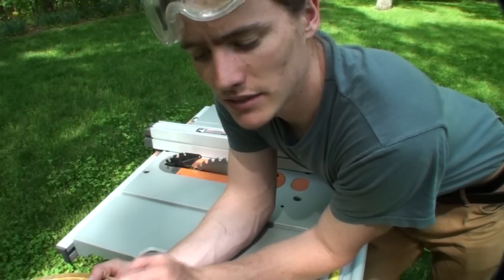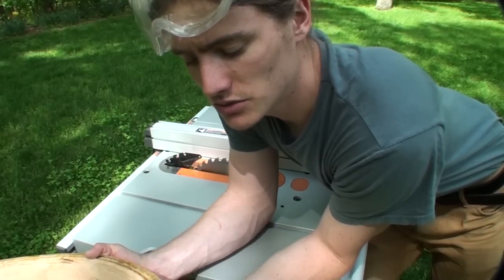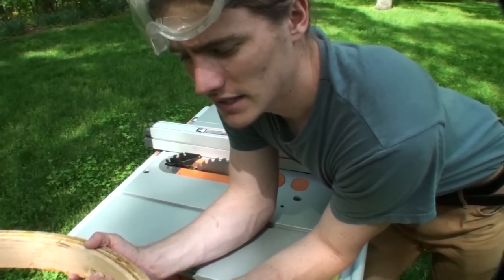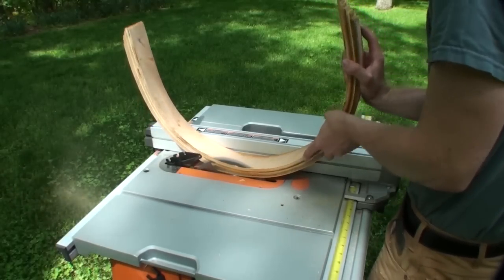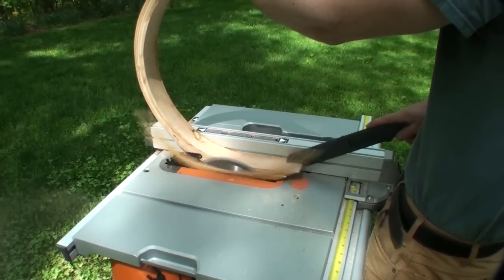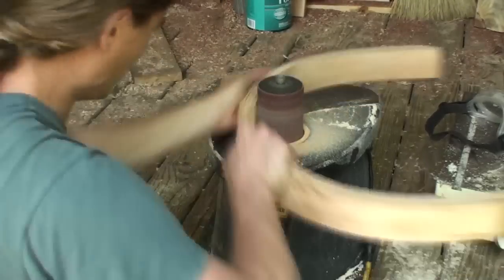To cut the opposite side of the curve to parallel the sides, I'm going to use the table saw. If you're not comfortable doing something like this, I wouldn't advise doing it — it is a little tricky, but it's really not that bad. You could also do this just by jointing the opposite side down to a line that you've already drawn on the outside and inside of your curve. The key with ripping curves is just taking your time — make sure it stays flush on the table against the fence, and aim for your lowest contact point right at the front of the blade. You could even do a dry run with the blade not raised to make sure you're prepared and have your push stick close by. For smoothing, I used a little belt sander and then my spindle sander, but you could use all kinds of tools.